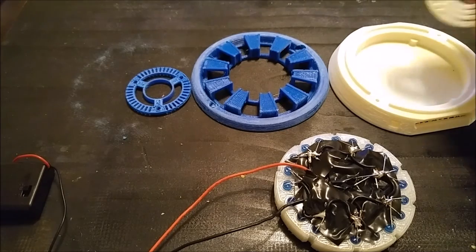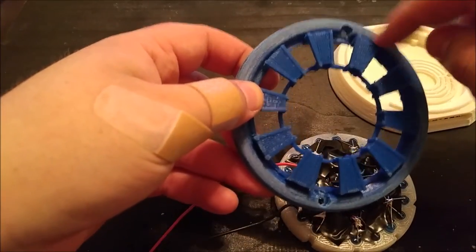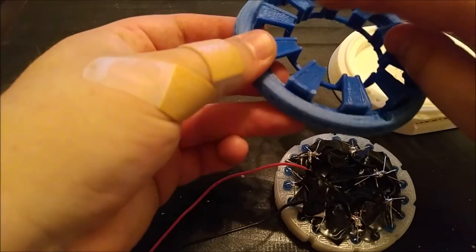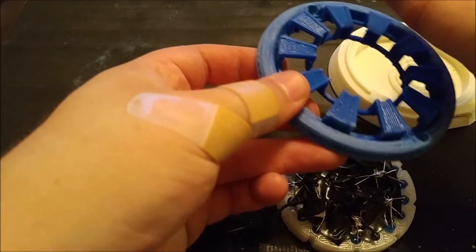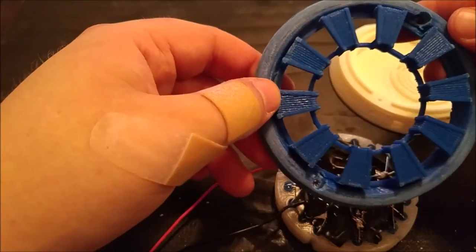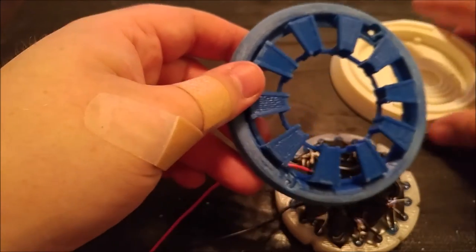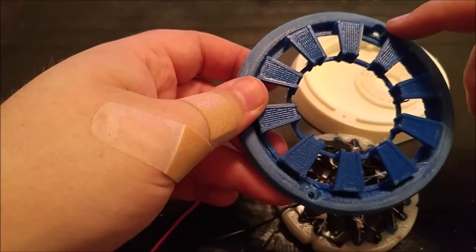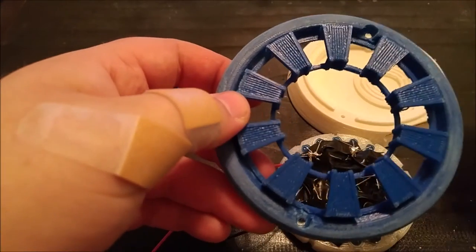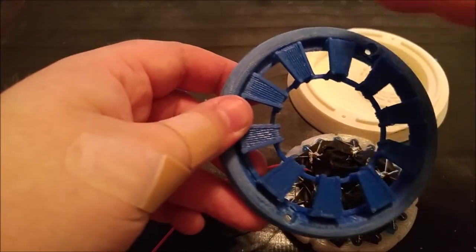So I sanded those down, and I also did one other thing. This right here — if you actually look at the original STL files, it doesn't have this. It has a hole down at the bottom, but it has like a little slit where you're supposed to be able to put the screw down, but I did not feel like worrying about that. So I went ahead and took a drill and kind of drilled both of these out. What that's going to do is I'm going to put the screw in and when I'm completely ready to put this all together, I'll screw it into the base and then I'm going to take some ABS glue that I made. It's basically where I took acetone and combined it with ABS and kind of made a glue, and I'm going to fill it up here on top once it's all screwed in and then paint it with an airbrush.